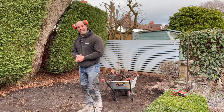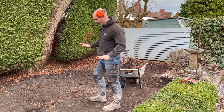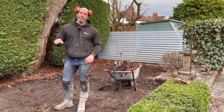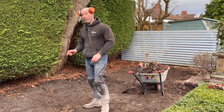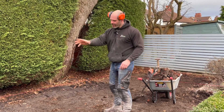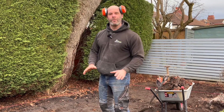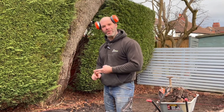That was a hectic couple of hours. All of that old deck is now in the skip and we've got this back to bare soil. We've just started to put a couple of string lines down nice and parallel so we can see where the new deck is going to go. The new deck is going to be supported on concrete blocks, so we've got some very careful setting out to do. Those concrete blocks are in turn going to be laid on concrete themselves, so it's going to be a very strong substructure. There's going to be a solid row to support all the joists and blocks every 1.5 metres to support the perimeter joists. A little bit of hand digging to follow, then we can get a mix on and get some blocks laid.